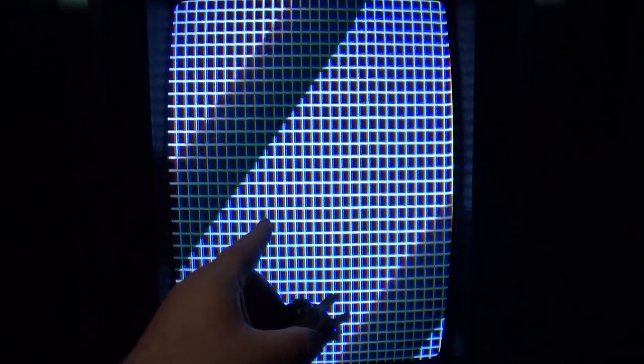Let me zoom in so you can see. You see my individual red, green, and blue lines? I want those to line up. I'm going to grab the original rings that came off the G07 tube. I'm not going to mess with the paint yet — I may not need to. I'm going to rotate this and push it in and out until convergence gets as close as possible. It may be dead-on perfect, or it may just be as close as I can get.